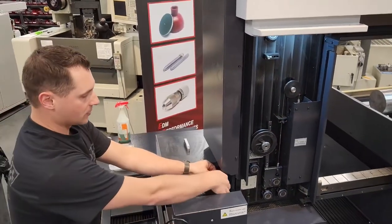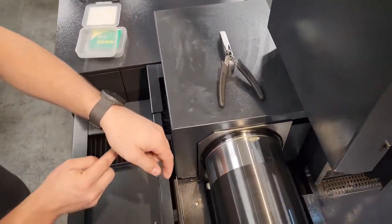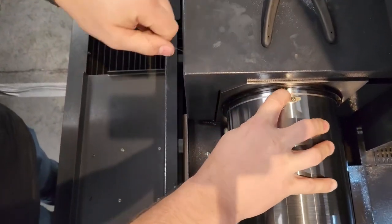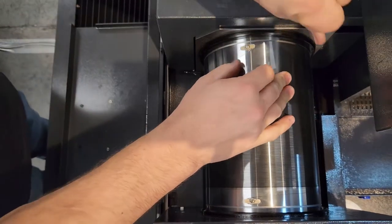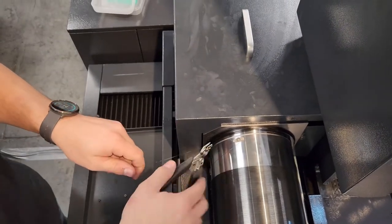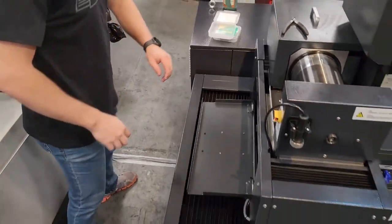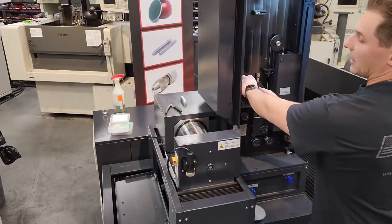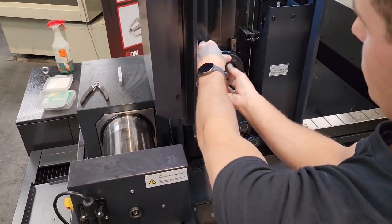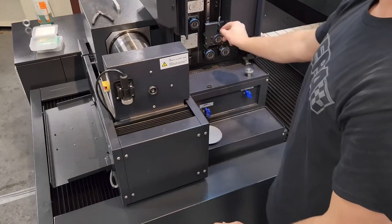I'm going to hold onto the wire from the drum side, cut it loose, and pull just a little wire back. Find a tab here, hook onto it, pull it a little tight, and go around. I'm going to have to pull this back off so I don't have to go around too many times yet. Cut that loose and go back over here — we can take our original spool off. Tie this off and put it to the side. Our tensioner, we're going to move it up.